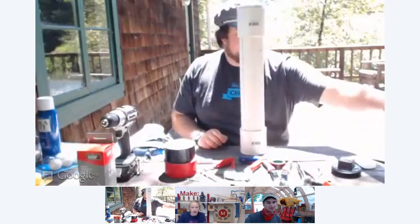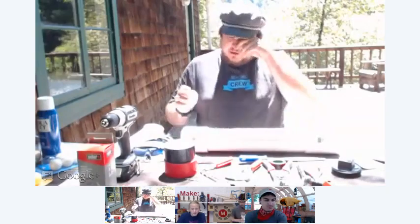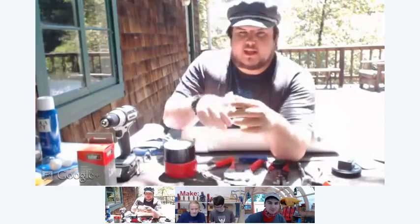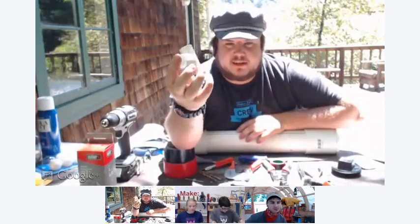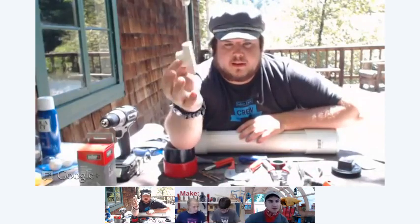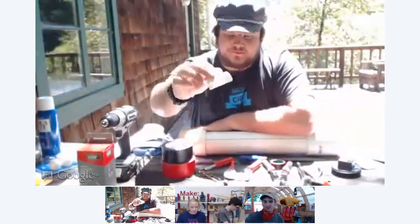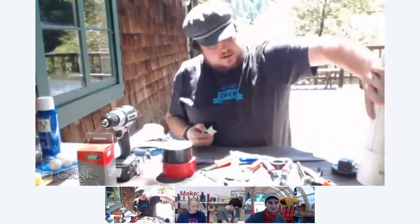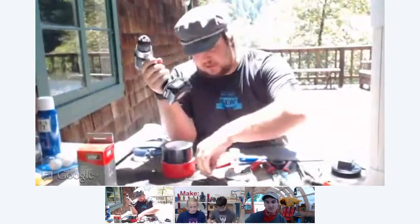All right, now we can move on to our grips. What you're going to need to do is get some 3/4-inch tees like this, and then you're going to cut off the bottom like this. Or, if you want to save a little money, you could buy a cross piece. You can just cut it in half. Oh, okay. So you cut off the bottom like this, and then we're going to take our cordless drill again, and we're going to use a 1/4-inch drill bit.